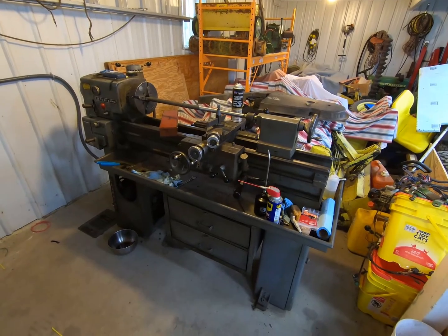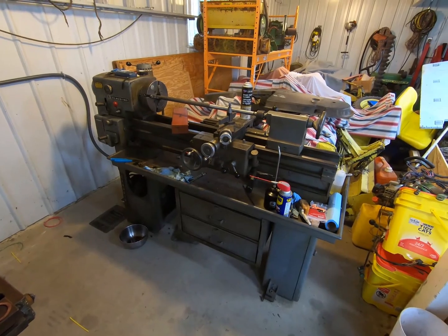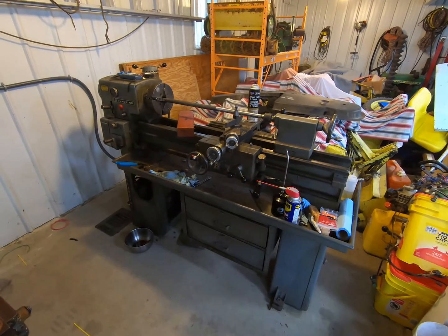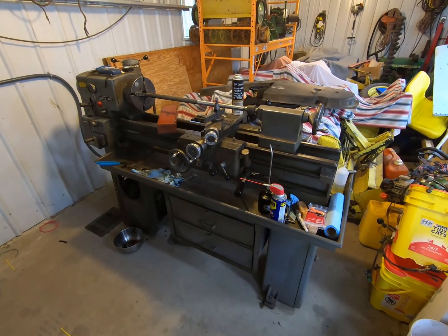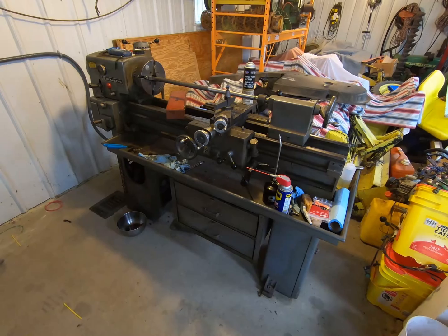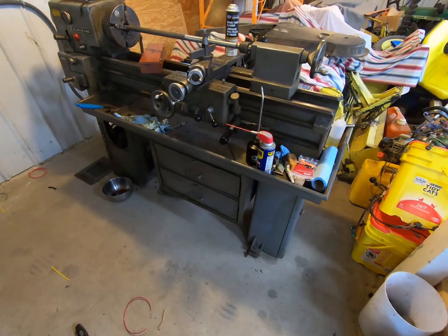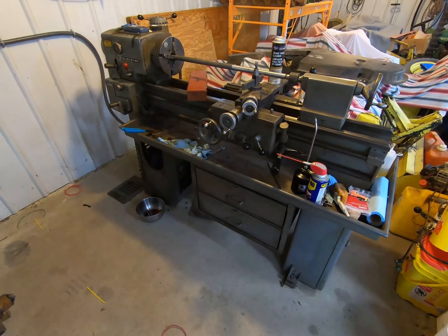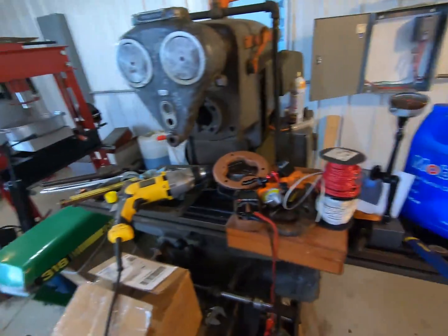I figured I would just go over what we did to get it in here. I don't know exactly how much it weighs, but we basically got it off the trailer using slings, then rolled it in here on multi-ton rollers — four on each foot — to move it, because it has a two horsepower three-phase motor.